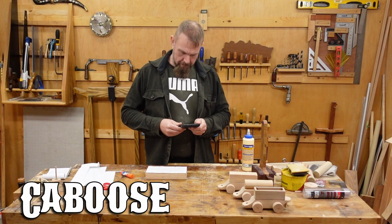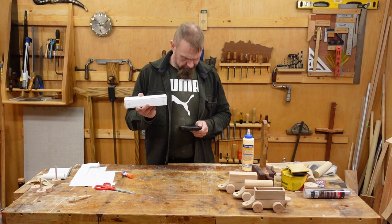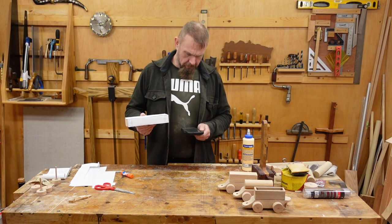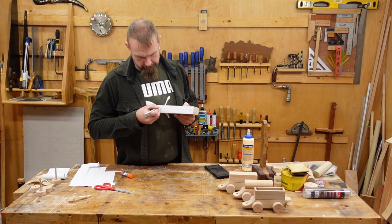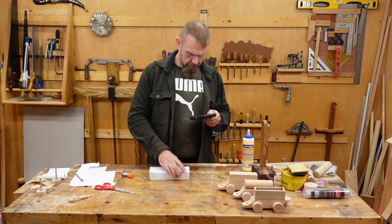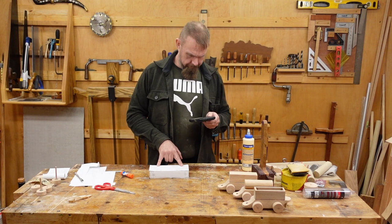Caboose. Construction of the caboose is much like the engine. First, use a glue stick to attach the caboose template to the sides of the 2x4 by 8-inch piece. There's a picture showing how to put the bottom one — put one of the cargo chassis templates to the bottom of the wheel edge of the 2x4. Only one of the 3/8 holes will be needed at the front of the caboose — cross out the other 3/8 hole. I'll drill all the holes next: one at 1-3/8 inch by 1-3/4 inch deep, two at 5/16ths, two at 1 inch, and two at 1-3/4 inches. Holes drilled out with no problem.